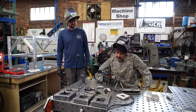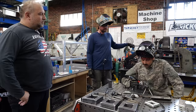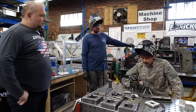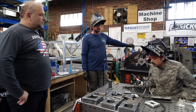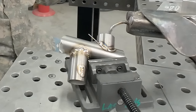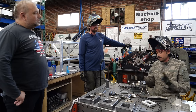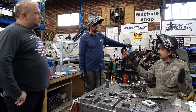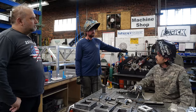I know we've talked about how expensive bike tubing is. I used to build bicycle frames and dealt mainly in different chromolys. But a lot of titanium bike builders like titanium specifically because one, you don't have to pay for finish — you can just blast it or anodize it. And two, you can buy it in 20-foot sticks versus a bike frame where every tube has butting and the thickness changes depending on the length of tube, which gets really expensive buying each one piecemeal. Some guys even do external butting and then shave it basically with a belt sander.